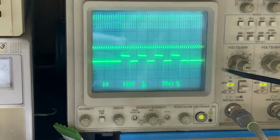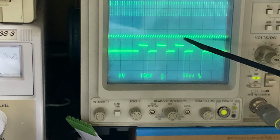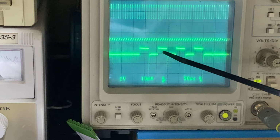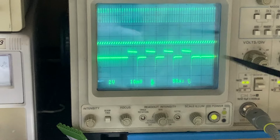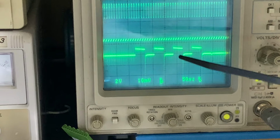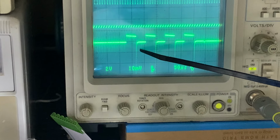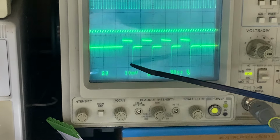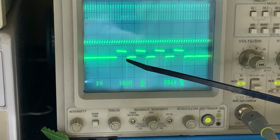That's when the transmitter turns on there, and there. And there's another long one in the chain of events, but I'm not going to worry about that. If I turn the wire around, this would be inverted, so that would be down there. Not that it makes much difference. But on these bits, just after, you can see the flyback from the transmit. This turns off, you get the flyback, flyback's gone.